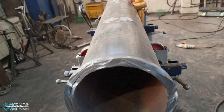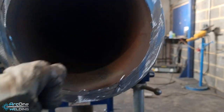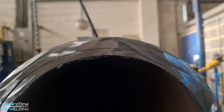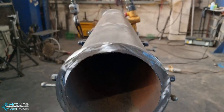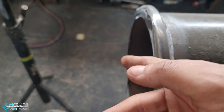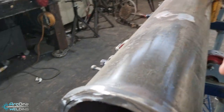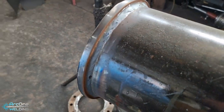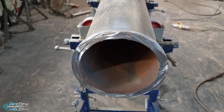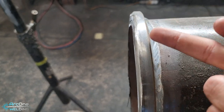That took 13 minutes to cut off — 13 minutes. Now I've saved enough of the pipe to reflange it and I just need to clean this up a little bit. Like I said before, if I burn through this direction the chances are it will gouge into the pipe, so I'm going to burn through this direction so when it cuts through the weld it's going to shoot upwards rather than down into the pipe. I could grind it but I think that's going to take way more time. This is the method I've found to be most effective, and you can see how much material I have left to stick the new flange on — if I had cut through the pipe here I would have had almost no material left.